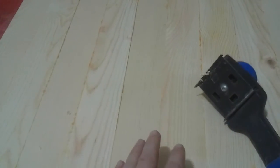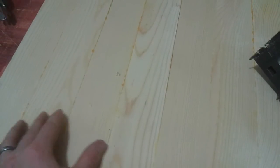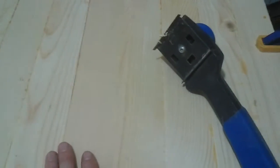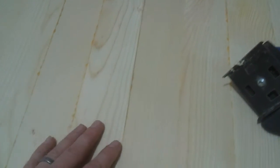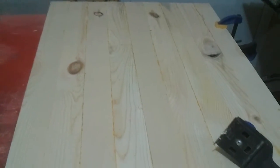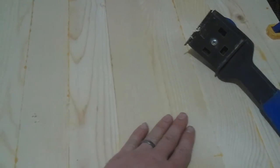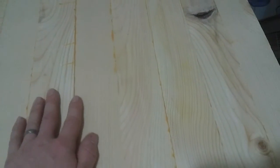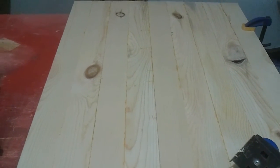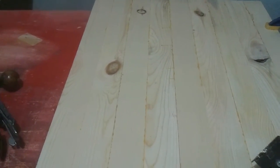Alright, here's the panel. I glued it up with two and a half inch strips so they'd match the same size as the rest of the skeleton on the blanket chest. Had a lot of glue squeeze out — that's good, that tells me all my joints are not glue-starved so it should last. I clamped two cauls across it on either side when I did the glue up to keep them all the same height. Right here in the middle I've got a couple of high spots — about 3/32 of an inch. But this is soft pine, nothing a bench plane won't take care of. So I'm going to get going on this, take a little while, and start painting the inside of the panels and we'll be good to go.